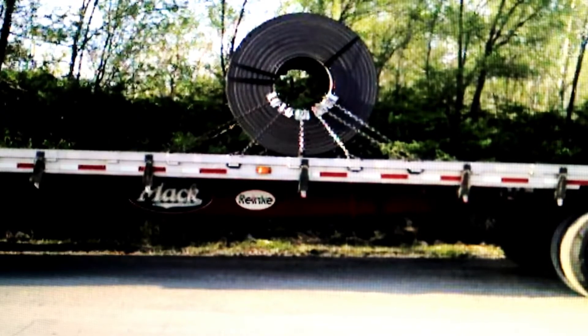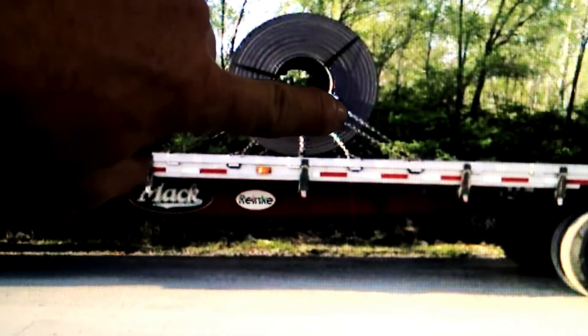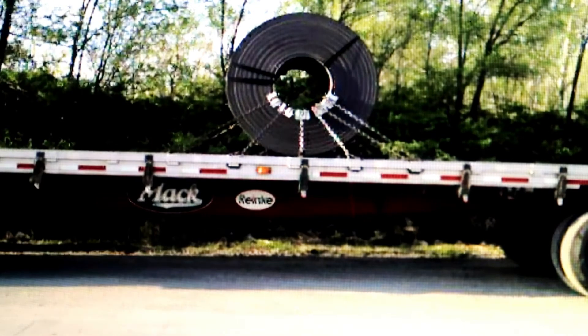You're supposed to have an idea of how much the coil weighs — 99% of the time they can tell you fairly closely. What you do is divide that in half and then decide how many chains it will take. Take this coil for instance — it's probably a 48,000 pounder, but let's use the easy number 44,000. That means you need at least 22,000 pounds worth of tie-down to make it safe. In this photograph I've got 5/16 and 3/8 inch chains — the big 3/8 chains here, here, and here.